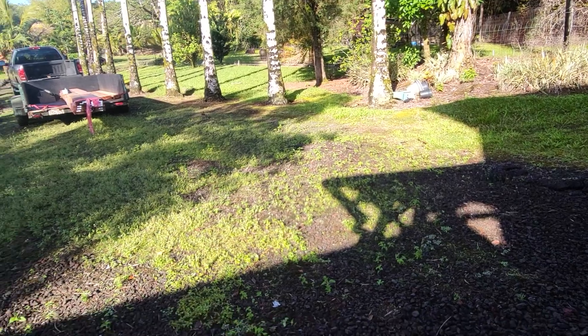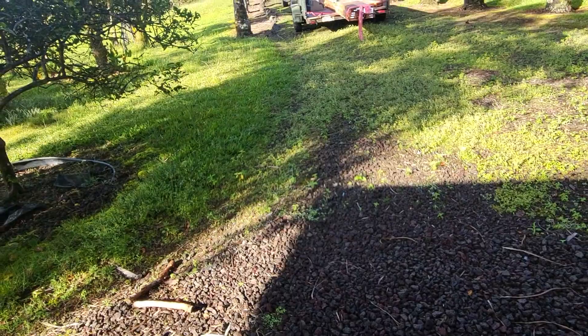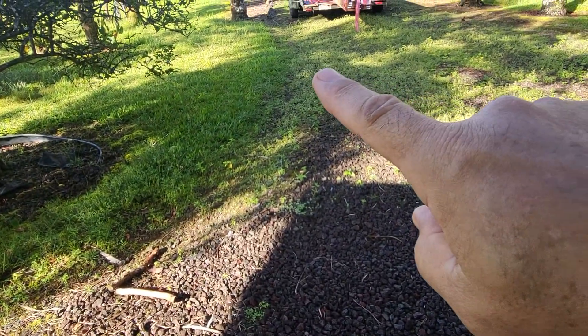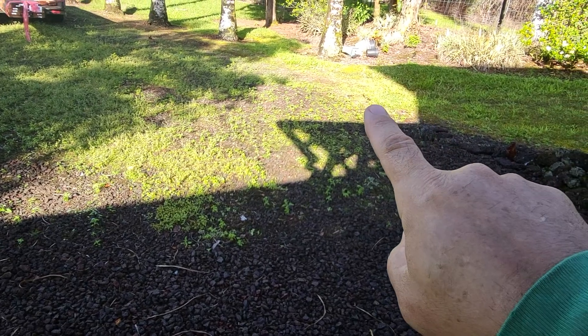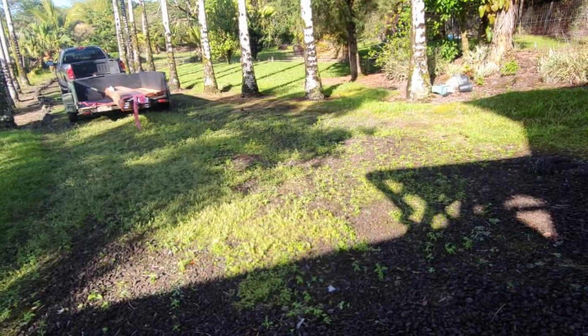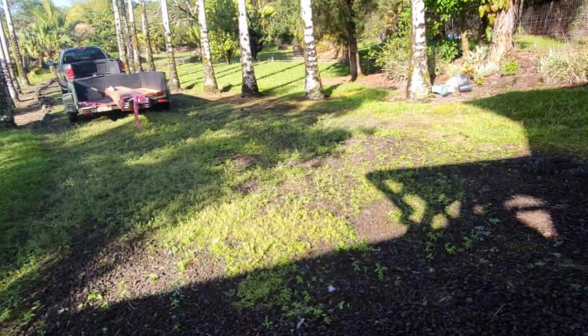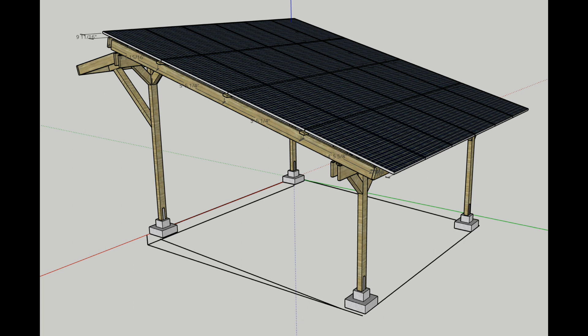This is what the irradiance looks like in this area — there'd be a corner there, another corner up there, and one here. Putting the solar array in the carport area as opposed to a ground mount further out in the yard was a bit of a trade-off. I would have gotten more sun earlier from a ground mount in a different position, but I really wanted a covered carport area anyway. It just made more sense to combine them and have a larger panel count to make up the difference. There is quite a bit of shading right here.